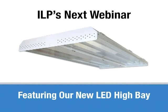Thank you very much for joining us today for our webinar. Our next webinar will be next month, covering our new LED high bay. Our 200-watt LED high bay is through safety testing and submitted to the DLC for listing in the high bay category. Our 200-watt product puts out 107 lumens per watt and should lead the market in both efficacy and cost. We also have a 150-watt product that will outproduce a 4-lamp T5HO at very long life with LED power. We are also developing a 400-watt product for retrofitting 1,000-watt metal halides. Please contact your ILP inside salesperson for technical information about this and our other new innovative LED products.